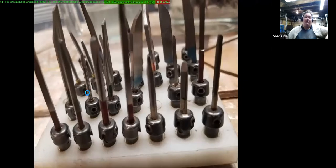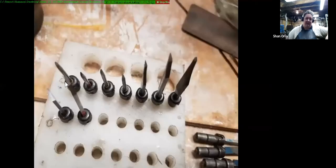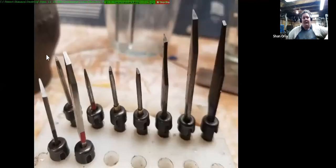This is a 1200-grit diamond plate for sharpening. I do 45-degree face on all the gravers — the face is this portion here. The angle has to do with how metal is carved away; 45 degrees works well for everything I handle. This face here is at 45 degrees to the length of the graver, and that allows the metal to come up.